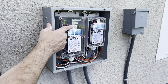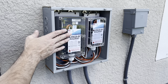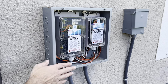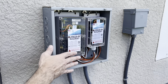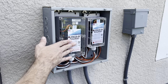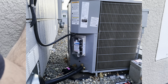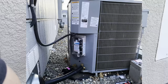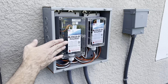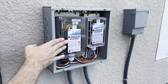You can monitor and diagnose using an application from the manufacturer, which is really cool. I installed them here on the wall and added extra cable. They come with about two to three feet of cable, so most people install them next to the AC unit. I wanted to mount it on the wall, so I extended the cable. This is the Micro Air EasyStart — this is what you need to lower your LRA, or starting amps, from your AC units.